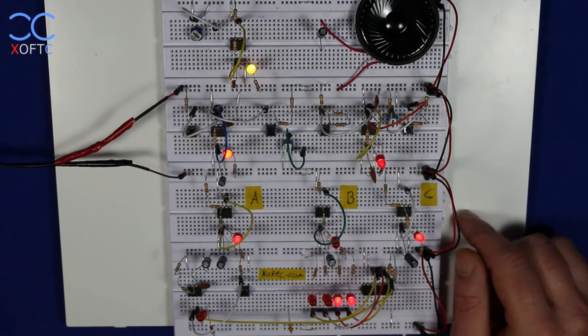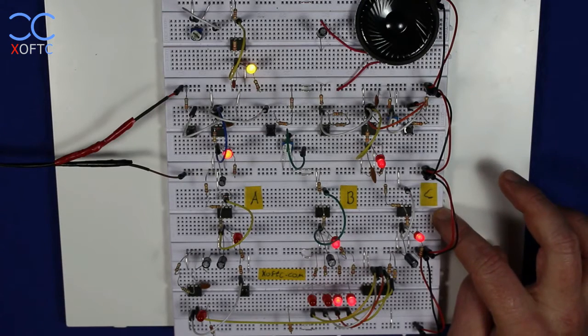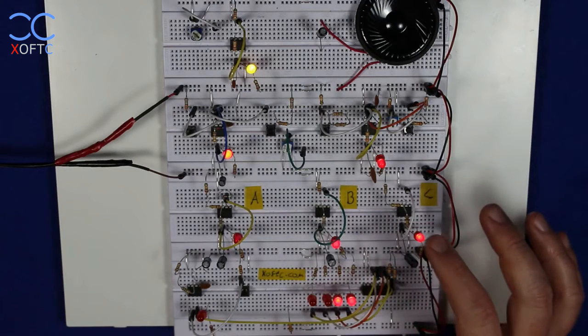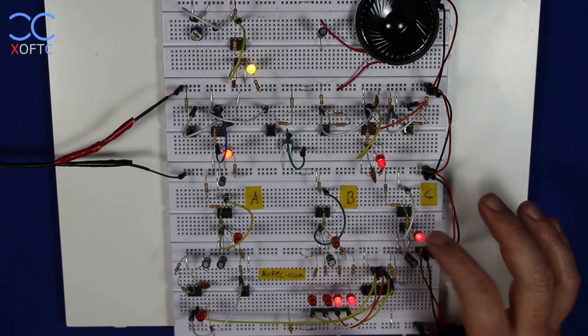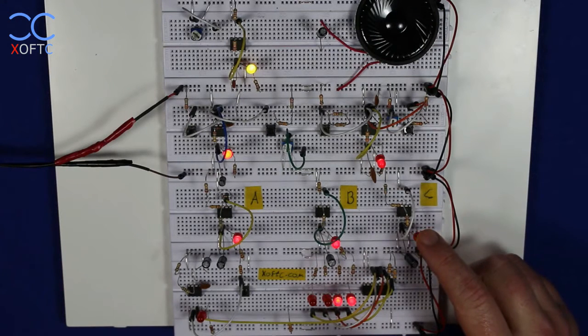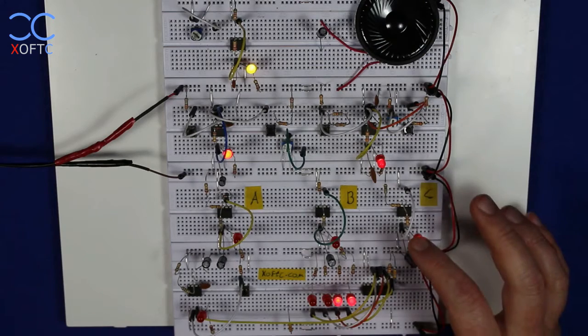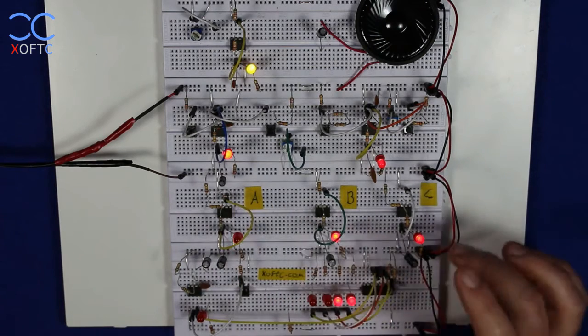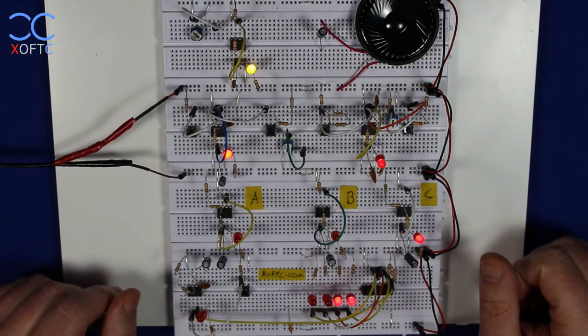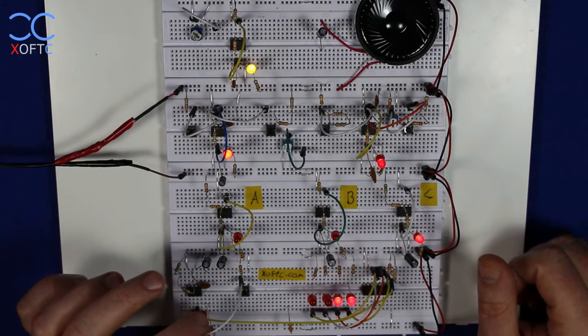When we talk about astable mode in comparison to monostable mode, we no longer define the signal that is coming out as a pulse, as in monostable mode. We define that as a frequency. And to explain that, when we use monostable mode, we define the circuit to provide a pulse of 2.2 seconds, for example, and it will produce that pulse for 2.2 seconds.